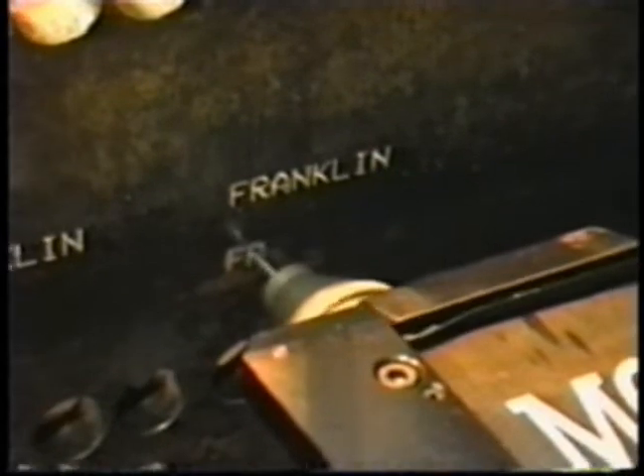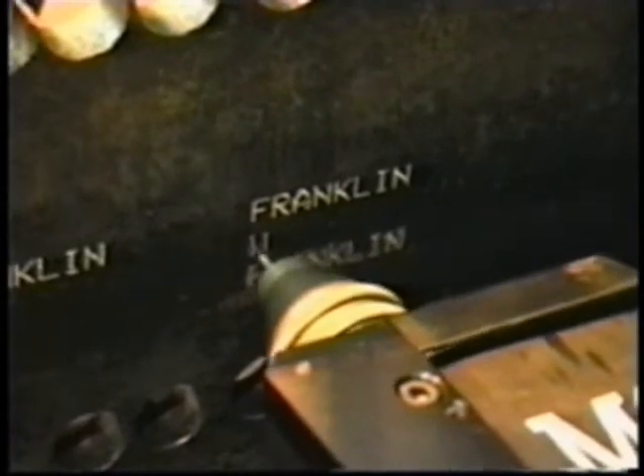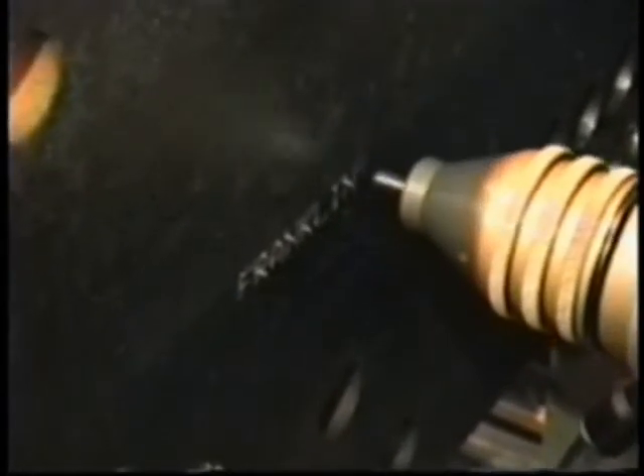The optional MC 2000 marking system provides deep stencil marking that can even be galvanized. The MC 2000 is fully integrated into the HD 145 CNC control system. Multiple line programming can be generated for identification such as job number or part number. The length location of the part name is fully programmable. The deep penetration is considered low-stress and is suitable for fracture-critical members.